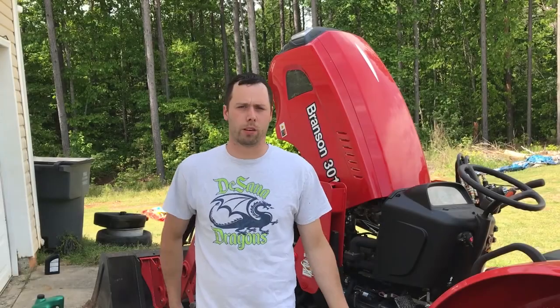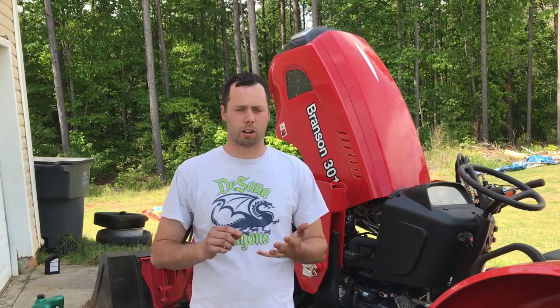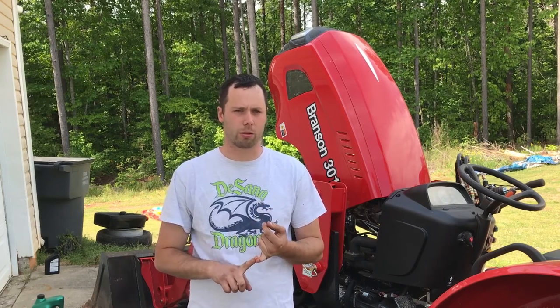Hey everyone, I want to give a little update on the tractor, some of the work that I got done today. Put in a little over 4 hours, like 4.2 hours on the machine. Some of the things that I learned is I did not have the machine in low range when I was doing digging or loader work.